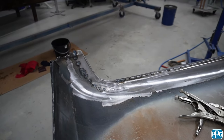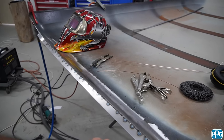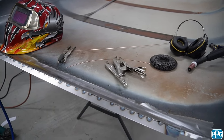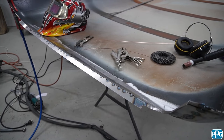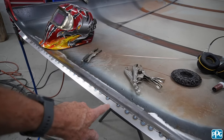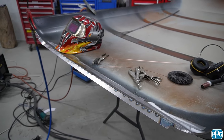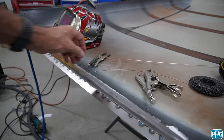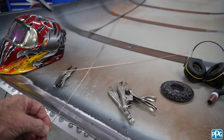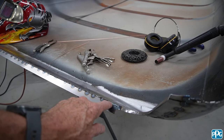So that part that I made up yesterday, I've got it tacked in there. Now I'm just working my way across this back edge — there wasn't much of the edge left on it. What I've been able to do is clean that up and then I've put my straight piece of 20mm body steel across there. Once I get that welded in, I'll actually trim it back to the width that I require, which is only about 10mm. But by using the wider strip it's going to stop it warping with the heat — because if I used a narrow piece it would tend to want to move a fair bit. So I'm just about to weld that. I've just made myself up a few pieces of 1.2 low tensile MIG wire rather than 1.6, because I don't want to have a heavy build that I've only got to grind back off again.